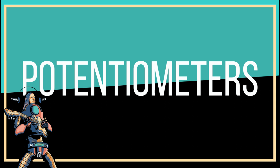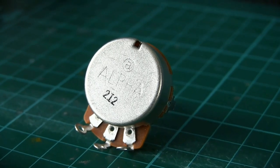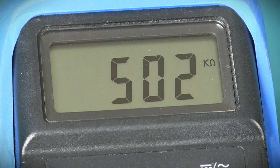Potentiometers. Resistance settings can help us identify which potentiometers are in our guitars. While the value is usually clearly printed on the metal casing, this can sometimes be obscured by solder or omitted entirely. Pot values are typically 250kΩ for single coils and 500kΩ for humbuckers, although one megaohm pots can sometimes pop up in certain places. The 2000k setting on our multimeter will read resistances up to 2000kΩ, so probing the two outer tabs on our potentiometer will allow us to see which of those three values it is.